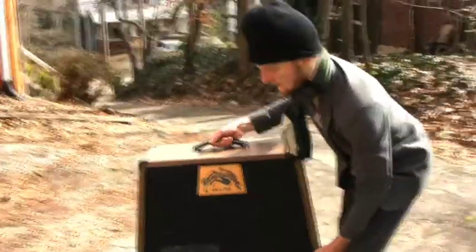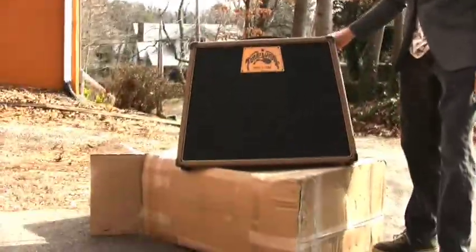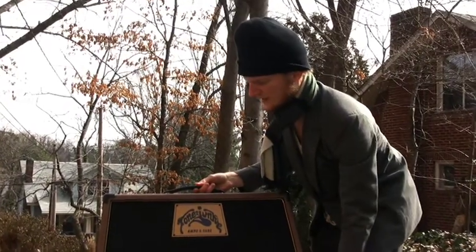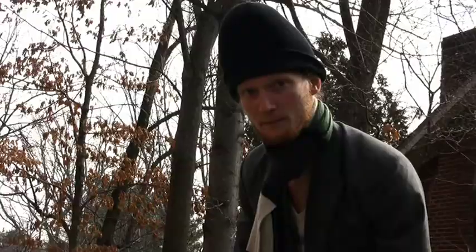However, opening it up will create slightly more volume because the speaker efficiency will be increased, not having to deal with standing waves. This particular cabinet design is trapezoidal, intended to reduce standing waves for ease of sound pressure levels and also for optimal tone. Standing waves are pretty nasty — you get a lot of them in square boxes and rectangles. When you go just slightly less square, the reflections won't run rampant over your tone.